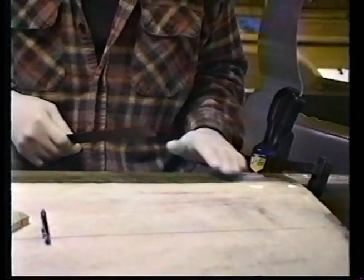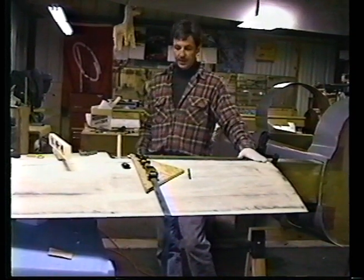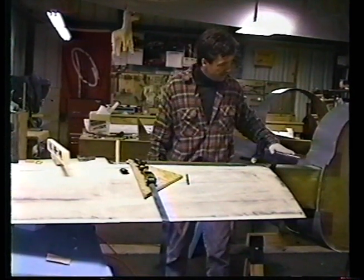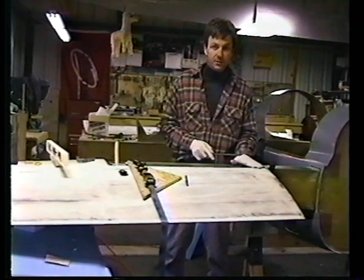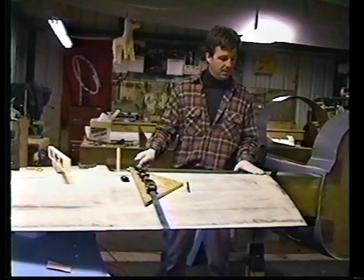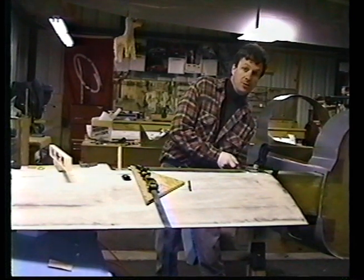You have to also take into consideration how much fill you have here. This is a little high right here, so it'll be less. The bottom side is the same. If you've got a problem on the inboard end, because you have the strake ducking down and touching at this surface and then kicking up quickly to handle your cowl, the inboard end, the upper surface, has a lot of flexibility for fill, and you won't get yourself in trouble. This is the least flexible area, outboard top main spar. Underside, outboard, no problem. This area, average the upper and lower surfaces above and below the spar.